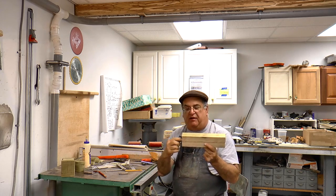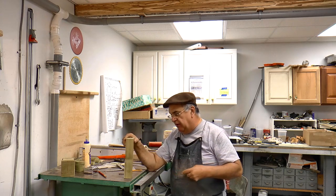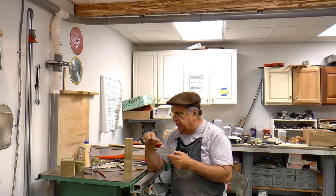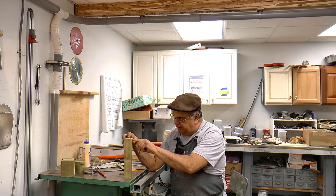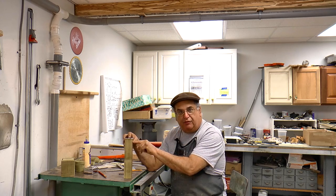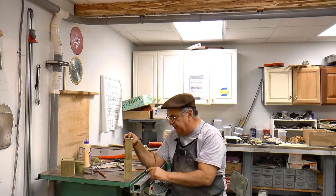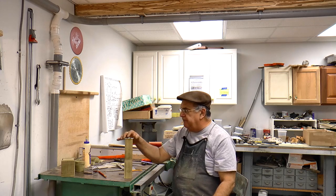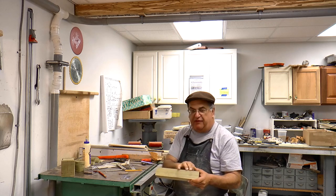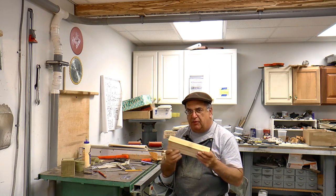I had this stuff fly apart. You put the center in there and you're trying to keep the center in, but the center acts like a wedge and pops it apart — that was a dangerous thing to do. So what I decided was to make a plate on there that holds it kind of together. I had to get past the screws, so I go down and turn this up to the right diameter, then take it apart. I could actually turn one of these — if I had enough of it — turn half of that and make it a core box. But I'm going to make a regular conventional square block core box and show you how that's made, and I'm even going to make some cores for you.